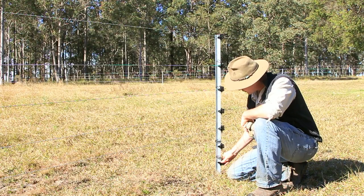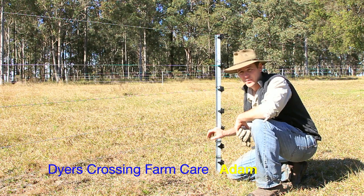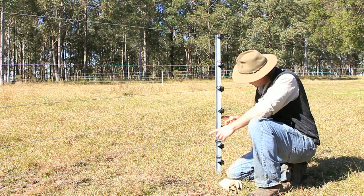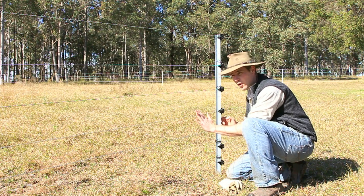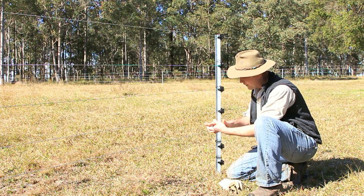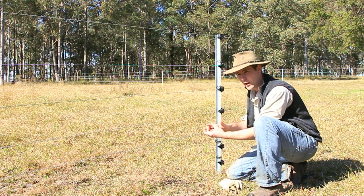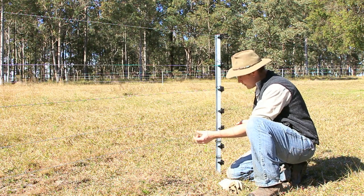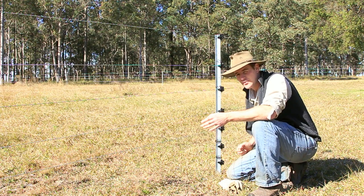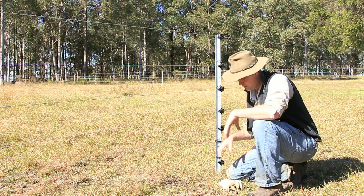Because it's an electric fence, obviously you use insulators — you don't pass through the wire. But even on fences where the wire isn't going to be electric, I still like to use an insulator. This was a trick taught to me by Les Roberts: by passing the wire through the hole, when you get wind or vibration in the wire, eventually that wears the thin layer of galvanizing off the wire at that point and you'll get rust there, and before too long the wire will want to snap right there at that point — and you'll get that at every post. So the wire will snap, you add a piece in, join it up, restrain the fence, and it'll snap at the next post. You'll get a deterioration at every post because you've just taken that little bit of galvanizing off that's protecting the wire from rust, and once the rust gets in, the wire snaps.